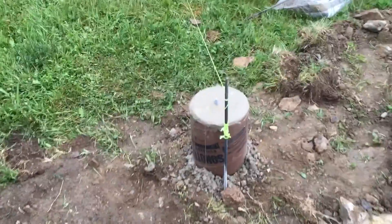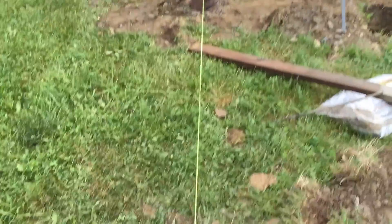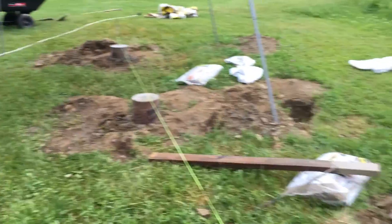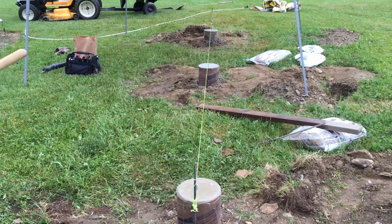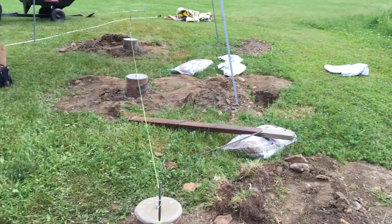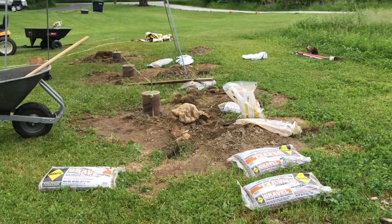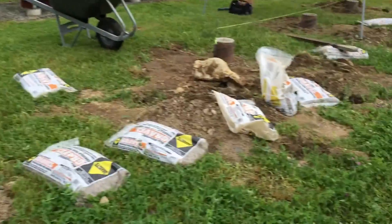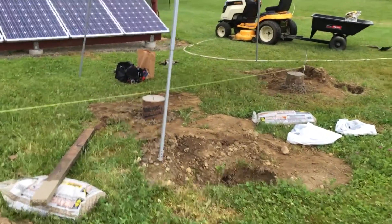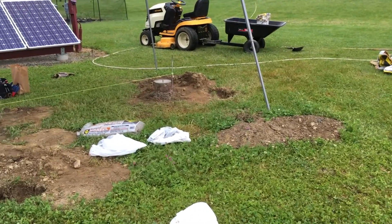I'm done for the day — got three done and I'm pretty pleased. I dropped my anchors and did the first one first because I knew there'd be a lot of time going from the second to the third while mixing everything by hand. Eighty-pound bags of cement, about two per sonotube — it takes a lot of energy and time. Over the next couple weeks I may just do one hole at a time. My span going across is about 55 inches. That wraps up part two of the DIY ground mount solar project — subscribe, leave a comment, and a thumbs up is always appreciated.